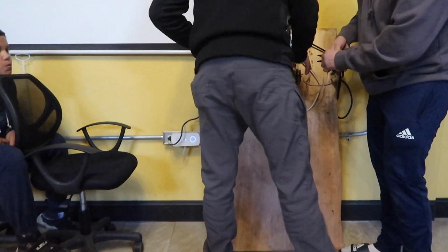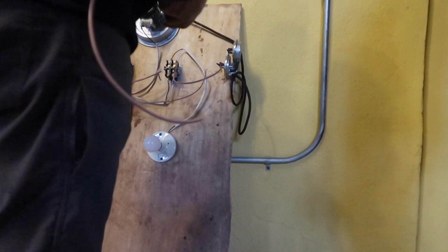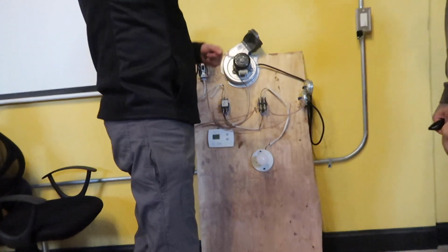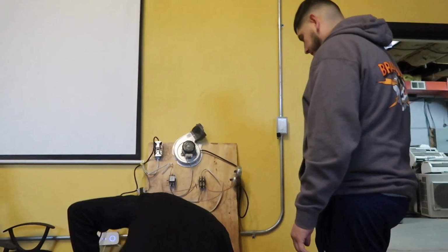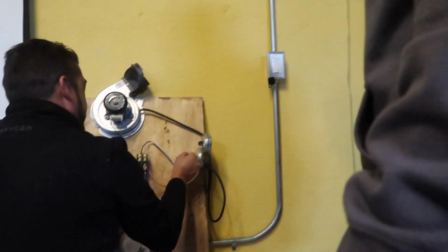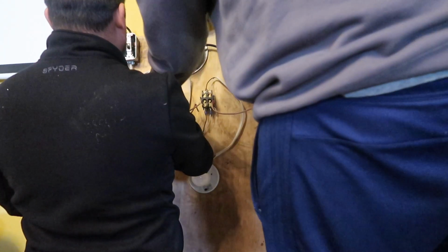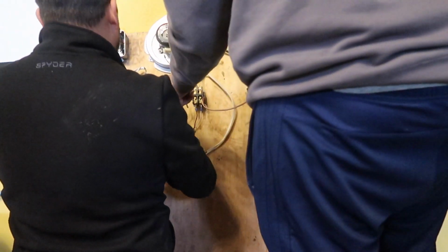No, but time out. That's wrong too. I'm telling you, because this contact will never give 24 volts unless the induced draft motor is on. Understood? Just listen. Okay, so look. Go to the transformer. Please, don't argue with me. It has to come out. Do you see this? What is this? W. All right, so this W should go here. It has to go to the first contact, the other side first. But where's this? What's this? This is common, right? This better be common.